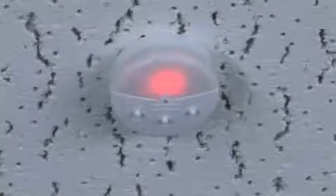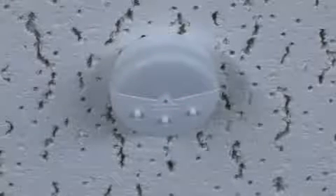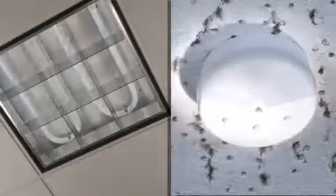The daylight sensor will automatically enter test mode. The sensor lens will flash every 5 seconds, indicating that the sensor is in test mode. Shine a flashlight on the daylight sensor — the dimmer should dim the lights in the room after approximately 5 seconds. Cover the daylight sensor — the dimmer should increase the lights in the room after approximately 5 seconds.